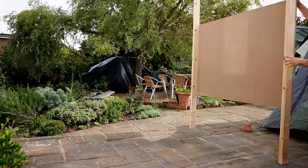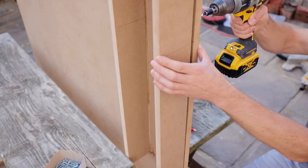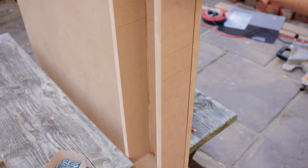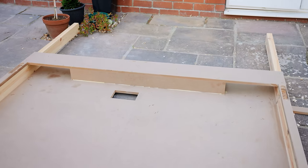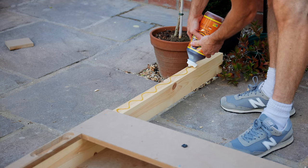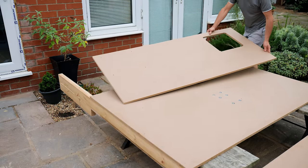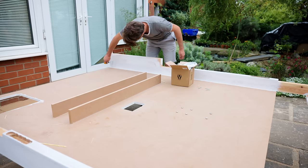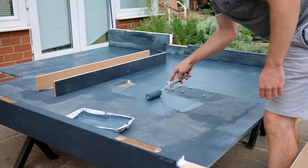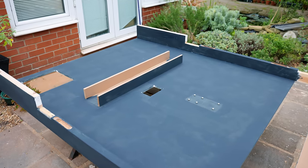There are a few additions that need to be added before it gets mounted to the wall. The first is to add a few strips of MDF to the top edge to make a long box, which will later be the centre speaker for the surround sound system. Above the speaker is going to be a chamber that houses all of the hardware hooked up to the TV, such as a PC, console, amplifiers and more. After a good sand down, it can be primed and painted — I'm going with a deep bluish grey, as being a dark colour it should be fairly unobtrusive when watching the TV, in addition to looking super modern.